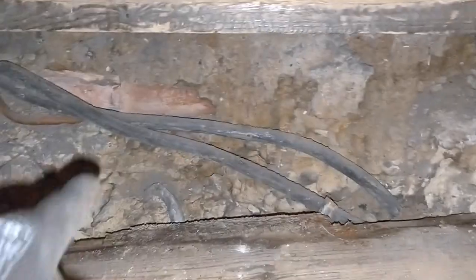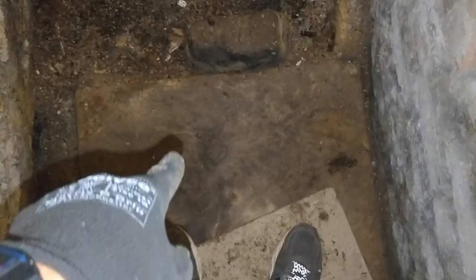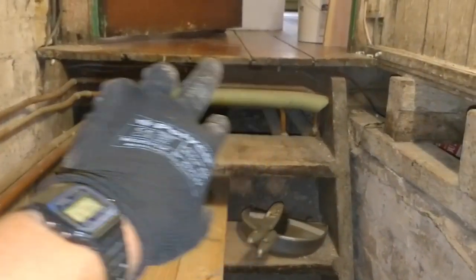This is a fairly new piece of 2x4 that's just been left here, so this could be the original cellar staircase. There's also a whole lot of old lead piping which has been decommissioned and just dumped there. What I'm going to do is, once I've cleared away a lot of this stuff, I'm just going to build on top of this concrete pad - which is perfect. I'll put a header plate under here and have the steps coming all the way down.